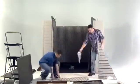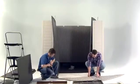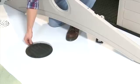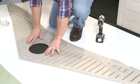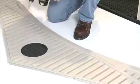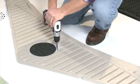The rear gable is next. It goes together, laying the edge of one side over the other and connecting with provided screws. Lay the assembly flat on the ground over the vent screen and louvered vents. To prevent the screen material from getting twisted up, punch a hole in it at each screw boss.